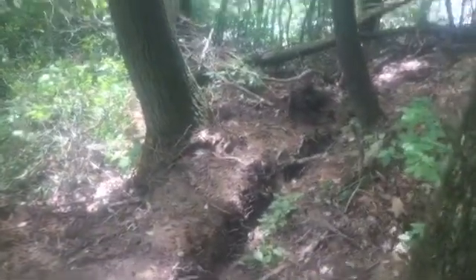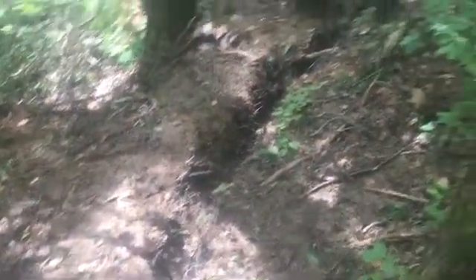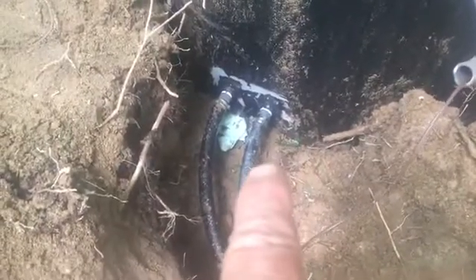I'm most of the way up the hill. I wanted to stop and show you that down here in this light spot is down where the well is. We got ditches dug all over the place. Right here at the rental property, we brought an additional line in and that comes up this other pipe, so there's actually two of them. One line comes from over at the rental property, which is the grid-powered pump, and one of them is the solar-powered pump that's coming up. What we did is put bulkhead fittings in the flat spot of the tank. This tank's going to get backfilled probably close to three feet high, and those pipes go inside the tank and come up — that way they won't freeze.